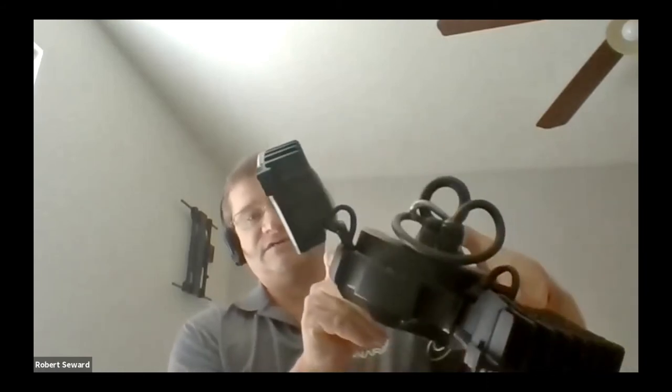I'll start my video here and show you a couple of options on this fixture. I have the 135 watt here — 21,000 lumens — probably one of our most popular because it is a 400 watt metal halide replacement. No tools are required to adjust. You can angle the fixture any direction — there's no set position. You can also use them for uplighting. On a pool job we're currently working on, they're using a six-wedge where three wedges will be pointed straight up for uplighting and three pointed straight down for your traditional high bay.